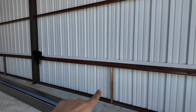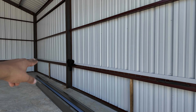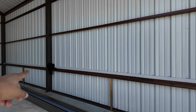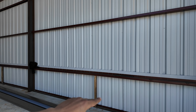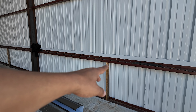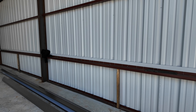You're probably wondering about these stickers. One challenge with C-channels is that they tend to sag, especially here where the span between columns is about 18 feet. The purlins tend to sag, so we set these stickers — basically temporary wood posts — to straighten it out. We bolt it and then take them out again once everything is set.